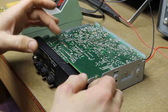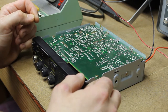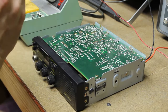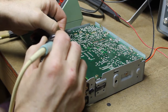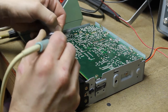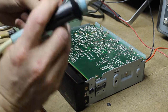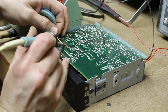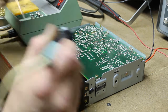So what I'm going to do is on each one of the five daughter boards, I'm going to go through and re-solder the connections. Use a little solder wick to pull the current solder off and put on some good quality solder. That way we don't have to worry about mixing solder types or anything along those lines — we'll just know that we have good quality solder here.